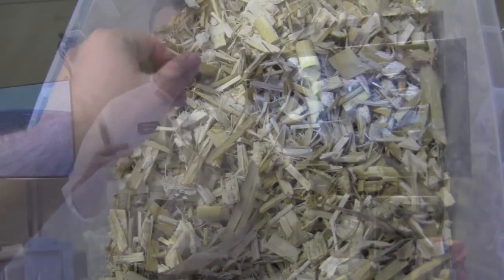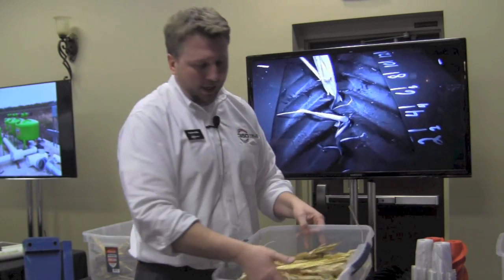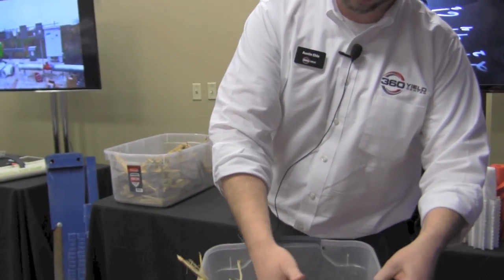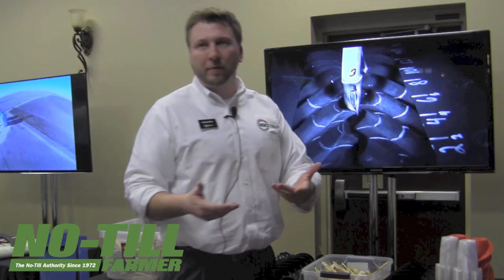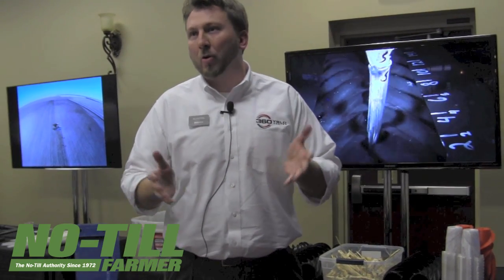With a finely chopped 'confetti' solution, residue packs like sand on a beach, limiting air penetration down through the foliage. With larger pieces, you can see how air flows through more easily — the soil airs out much quicker, we get on the field sooner, similar to a full or deep tillage advantage. It's like a carpet on your porch after a rain: pull it back and the wind dries it out faster.